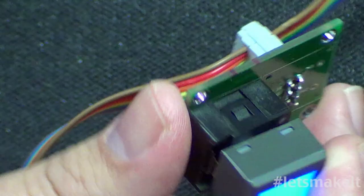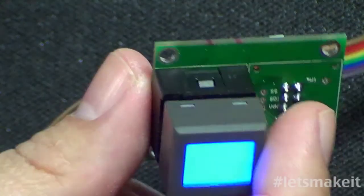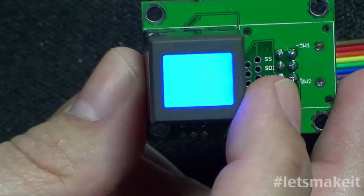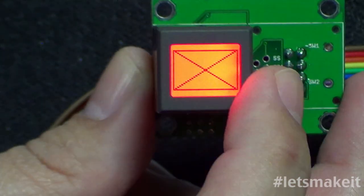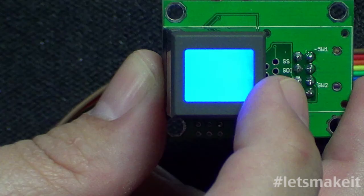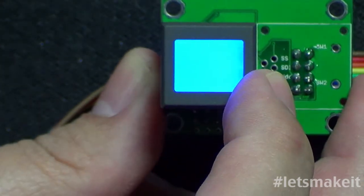So I don't call it a waste of a chip, but you will see some other boards that we have that have more buttons on them, and we can do up to 8 on one chip, because these are basically all getting the same data. We're just turning the switch select pin high for the one we want to talk to. And you'll see that in the code. We actually created a library, a smart switch library, that makes this very easy to do as well. And we'll make sure you get that library out there in the show notes, as well as the program we're going to show you.